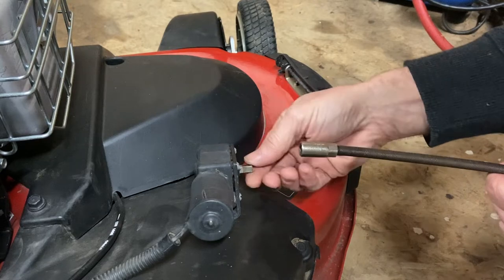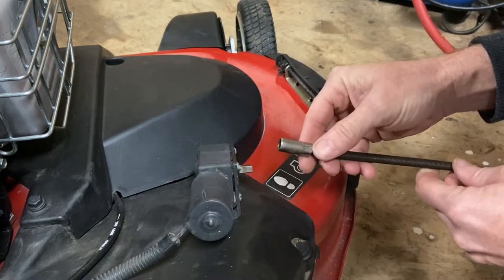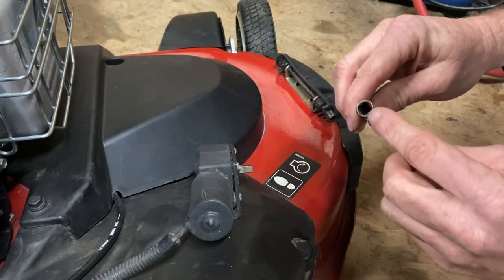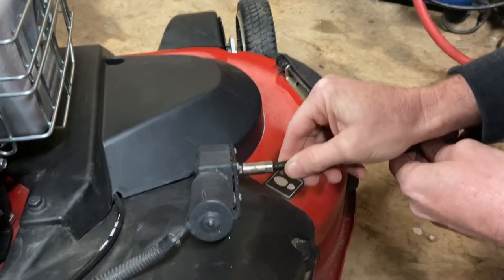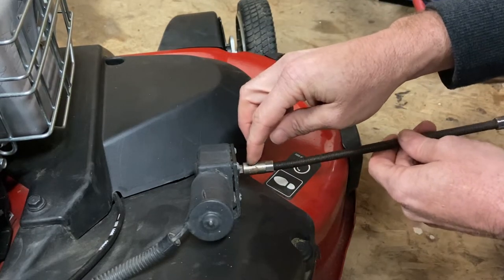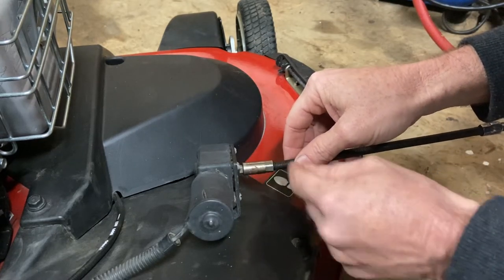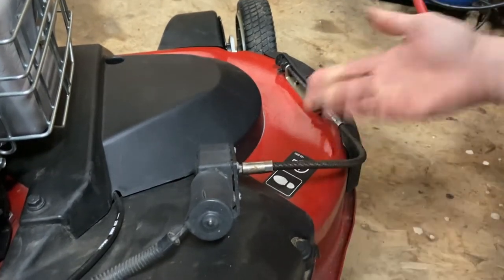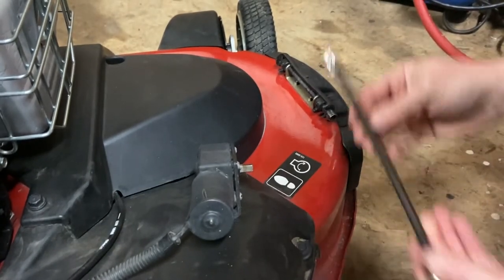If you get a longer one, depending on where you mount your motor, you can always cut it and weld on a socket to fit. On this motor here, the shaft was round, so instead of using a coupling, I shaved down the shaft to a square to match the socket. That way I can just pop it on and off easily — I wanted something quick to disconnect in case I needed to replace something, rather than dealing with a set screw or union.